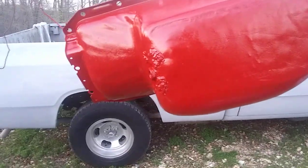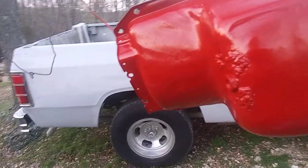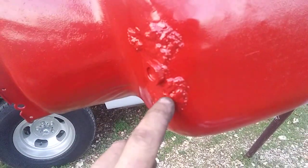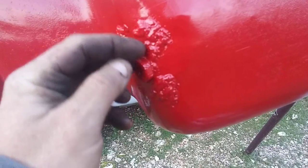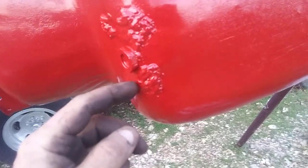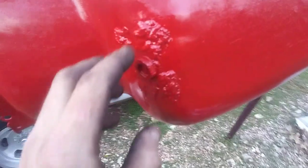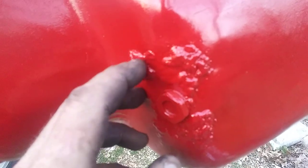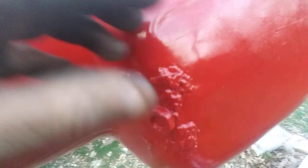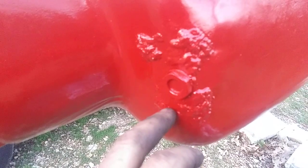I found a lot of other odds and ends of stuff that needed to be fixed. I had to fix all this back here — some of this was already like this, but then I had to grind and weld some, and I had to put a patch in here. So some of this isn't necessarily all my doing. But I got it all cleaned up the best I could. Then I pre-tested this — I filled it with water to look for any leaks, found a few small ones, and welded them up. There are more of these flat welds down here around here.